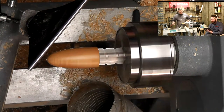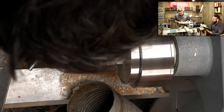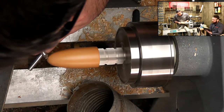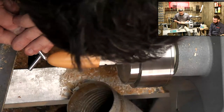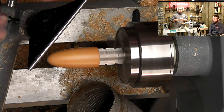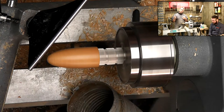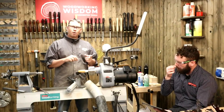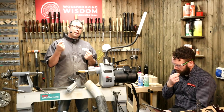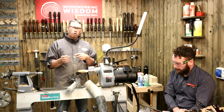As you just mentioned the sealer, Colwin, Frederick's asking, what's the difference or advantages between the spirit, cellulose and acrylic sanding sealers? Yeah, so acrylic is a water-based sealer. They're okay, you could use pretty much anything over the top, so waxes and lacquers, those sorts of things, that's fine. But it doesn't have the penetration that you can get with cellulose through oily timbers. What the benefit of a water-based is, water and oil don't mix, so you can put a lacquer over the top. You're not going to get any bleed through. It's not caustic in any way. It does take a little bit longer to dry than cellulose.